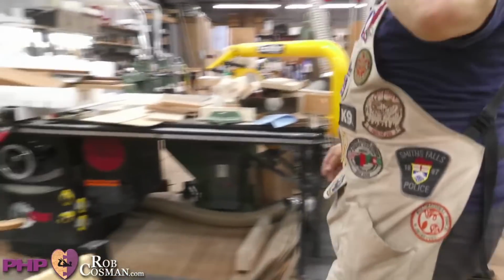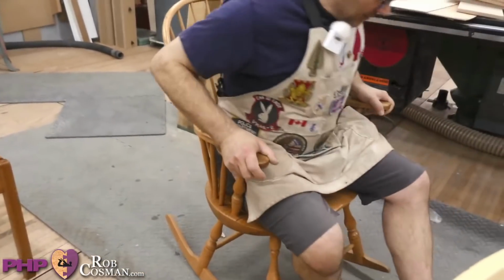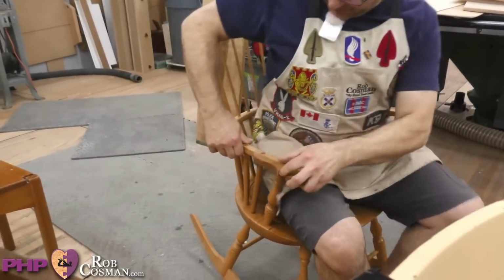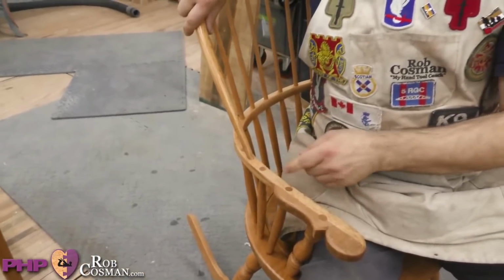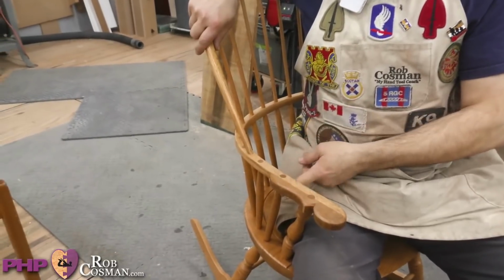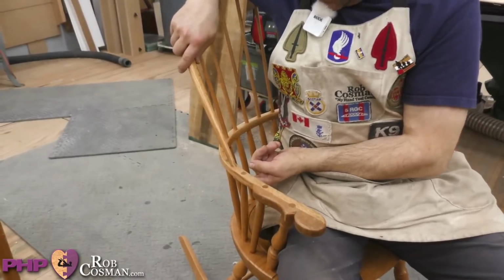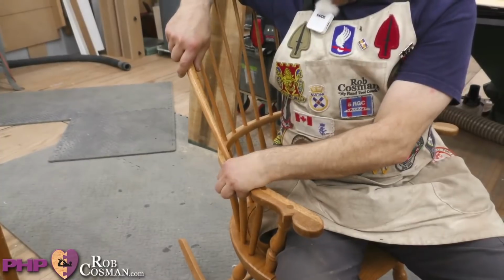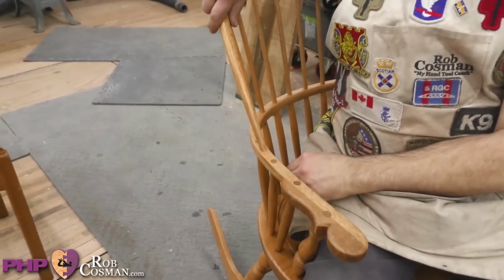This one has come loose too. Now, I didn't make this. I bought this from a fellow woodworker in Ontario. But which one is it, Jake? Oh, this one right here. So when I lean back to see how that breaks, these are all wedged. I don't know if you can see, but they come through the hole, and there's a cut made in it, and then it's glued, but then the wedge is driven in, and the wedge is not tightened up. So if I was going to go in and fix that, I would probably try to drive another wedge in there to expand that hole.